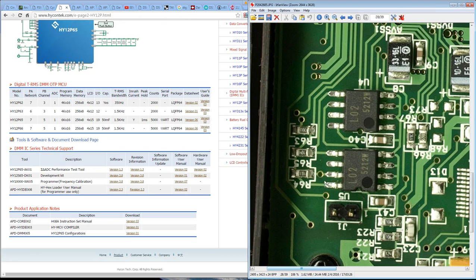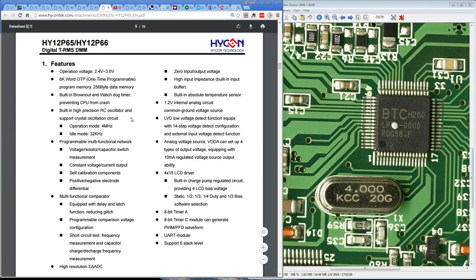And it makes sense that it's I2C, because look, if this is the power pin here, pin 8, then, because it's going to the bypass cap, this is going to the top side of a 10K resistor here, 103, 10K, very typical I2C pull-up resistor value. So that is potentially an I2C pin, but in that case, it doesn't leave enough pins left. Right, back to the data sheet.